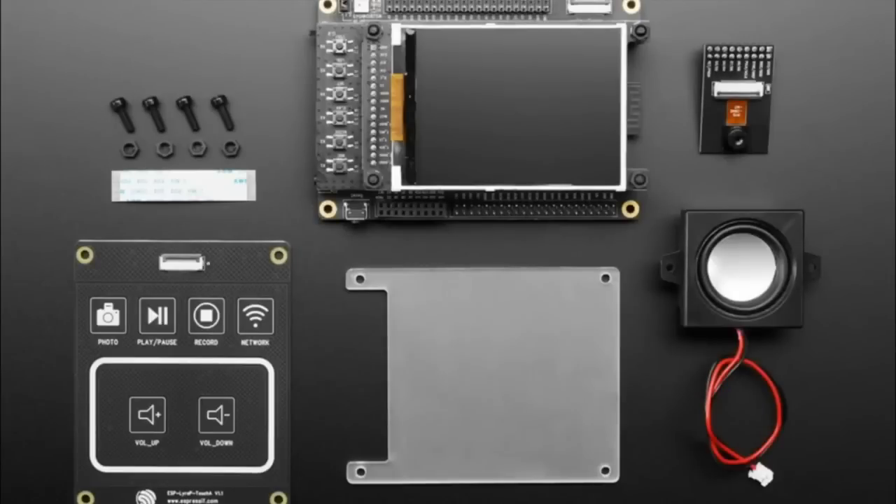This week is a week of twinsies — everything has two versions. This is the other ESP32-S2 development board: the Kaluga. The Kaluga is more fully featured and a little more expensive. It still has the ESP32-S2, but adds an I2S amplifier and speaker, a camera for the camera peripheral, a 3.2-inch TFT, more buttons, and a capacitive touch interface board. So if you want to play with all the hardware peripherals like I2S, capacitive touch, or camera, this dev board has everything.